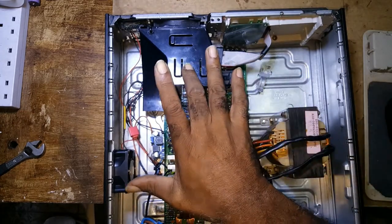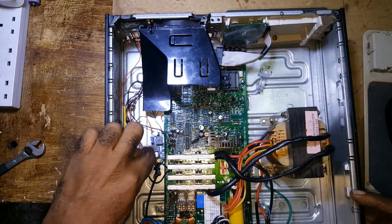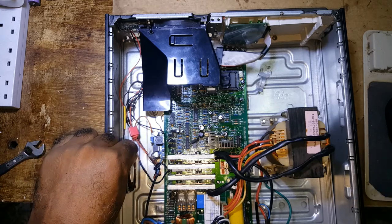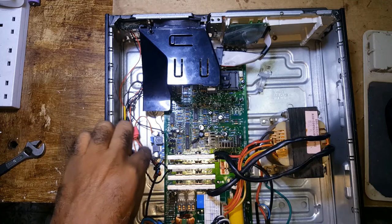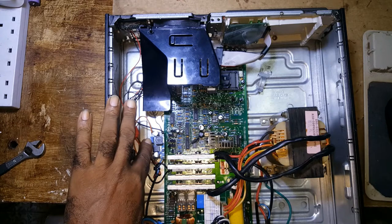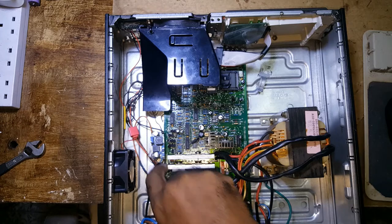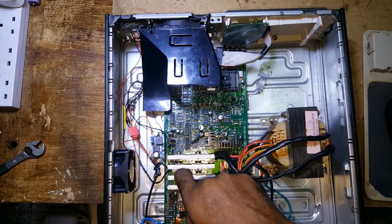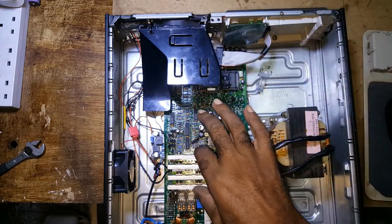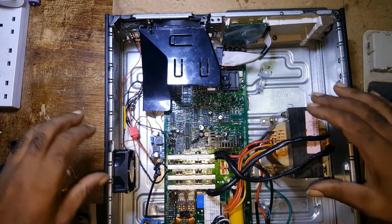For me to get 12 volts, this is a 24 volt system, I placed an LM2596 in here, connect it to 24 volts, dial it up with this pot to get a 12 volt output, connect to the thermostat, and wire the two fans. Anytime this gets hot, the fans would come on.